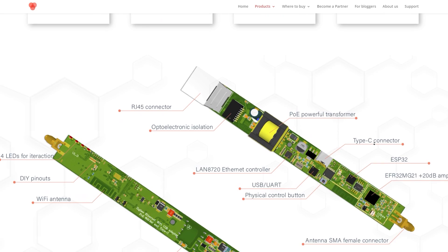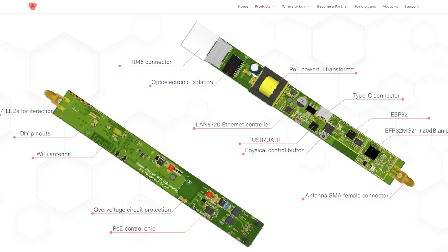On the outside they're identical and on the inside very similar. They consist of two ICs: an ESP32 that handles internet connectivity and provides web access — whether via Wi-Fi or Ethernet — and a Zigbee IC that varies by model. The standard SMZB-06 comes with CC2652P, the 06M uses EFR32, the 06P7 uses CC2652P7, and the light version without Ethernet uses the same IC as the P7.